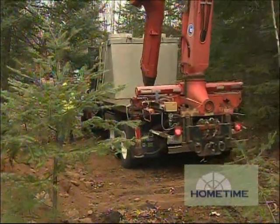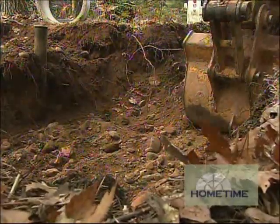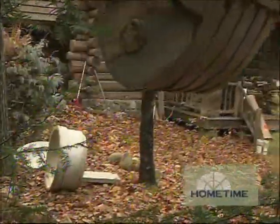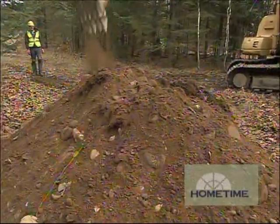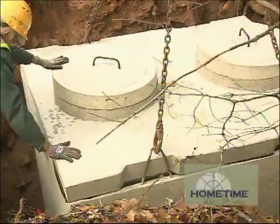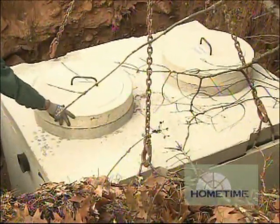To get started, we're going to come in and excavate the new hole for the new pump tank. That pump tank is about five by seven, and we do make that concrete tank ourselves. The depth of that tank will be about seven and a half feet deep. From the top of the cover, we'll bring manhole risers above grade, up to code, so we can set the pump in that pump tank.